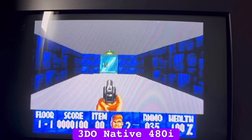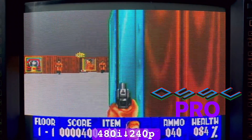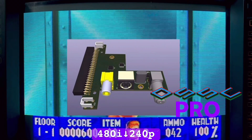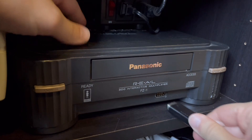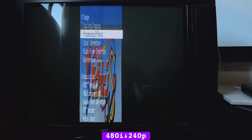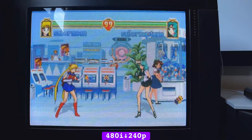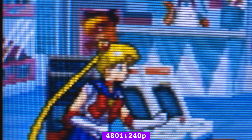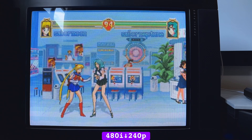The OSSC Pro was a great companion to the 3DO console to laglessly restore 240p from 480i without modifying the console, but having the extra AV outboard prevents using the eventual analog input board which also adds S-Video — essential if your 3DO isn't modified for RGB output. The RetroTink 4K has the advantage of composite and S-Video inputs, so I tried my luck at downscaling 480i to 240p. By default the image is overscanned, but unfortunately the pre-scale didn't affect 480i to shrink the vertical scaling. Within the de-interlacing menu, if you select CRT simulate it'll do most of the vertical scaling for you, but does the same fake 480i interlacing as shown previously. I didn't test much beyond this point, but don't let me discourage you from better optimising 480i downscaling.